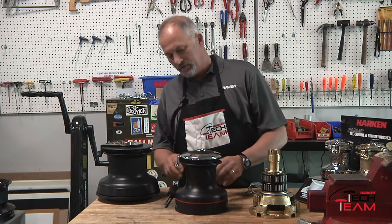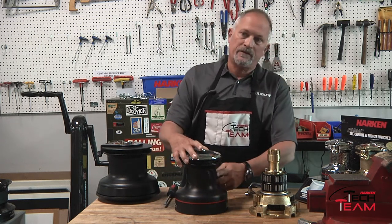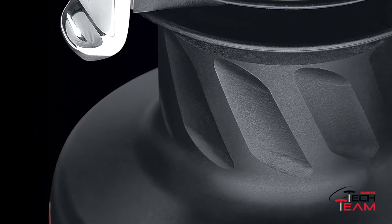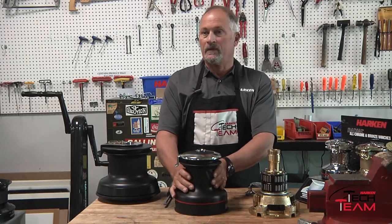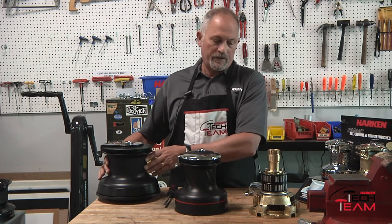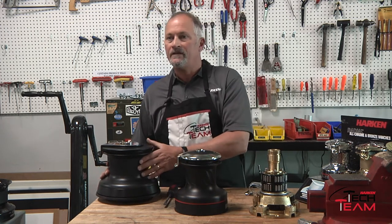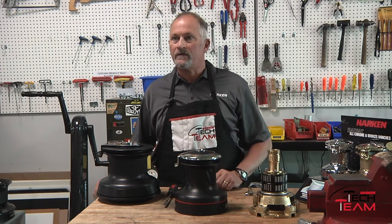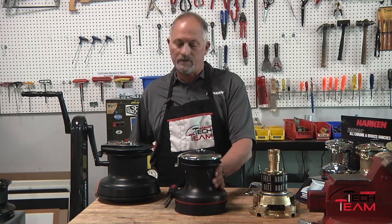This is the radial winch. It's noted for its radial ribs on the drum, which gives a very good grip and less wear on the line. A standard sandblasted drum can be very abrasive to the lines and can also wear out after time, so then you don't have enough grip. So with the radial line, it kind of solves that problem as well.